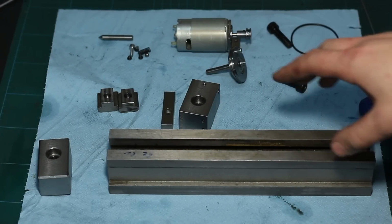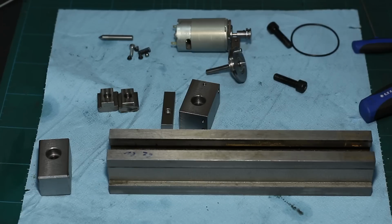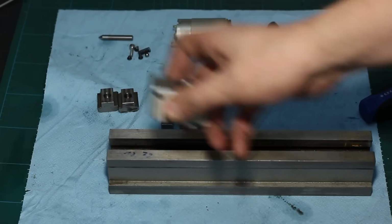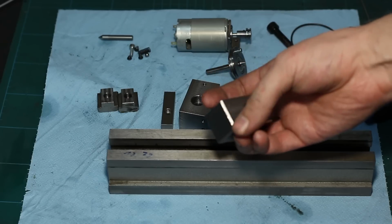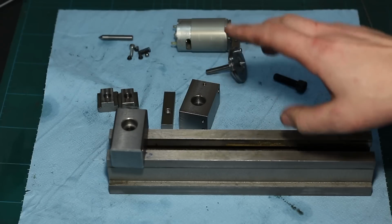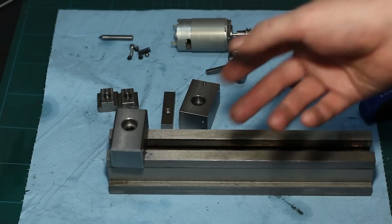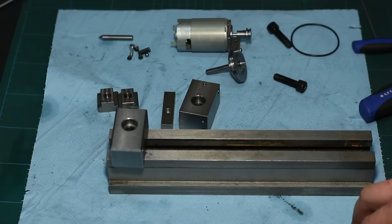Okay, and now as I already have it completely apart, I can finish all the parts. I'm running them over my chamfer milling machine to give them a nice heavy chamfer, most of the parts. And the other parts get chamfered by hand with a file, and then I finish them with Scotch-Brite and a sanding sponge.